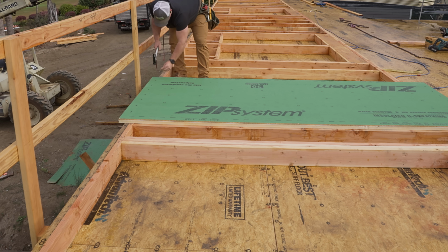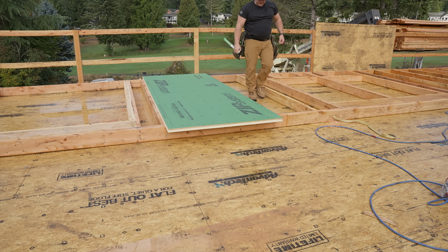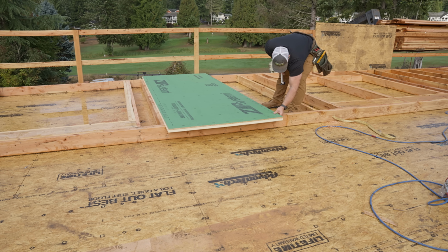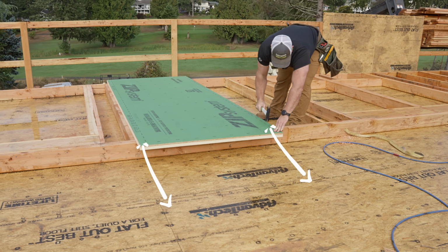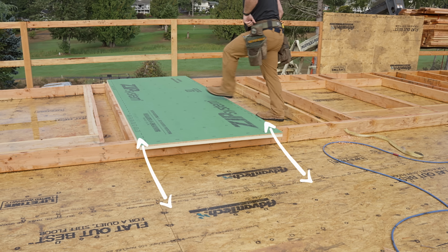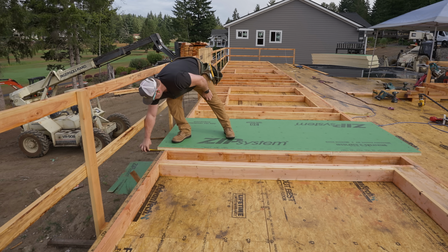So where I'm starting at the bottom, I'm burning a certain amount because I'm going to catch the rim. I'm right on that layout mark. Because my wall is square and all those marks were made, you just saw that, right, with the layout stick, then if I pull the panel to the mark, the pencil mark, now I am dead center. And you can see the seam where I'm at, the seam on the left on the floor. Those centers go all the way up through.